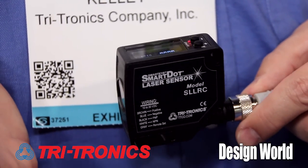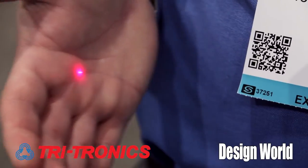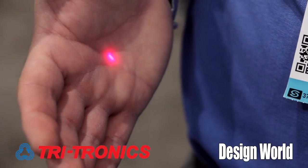Yes, this is a long-range laser. The SmartDOT normally went out to about six feet or so, but we had a couple customers that asked us specifically for 20 and 30 feet range to the reflector, with no misfirings up close. So we had to continue to polarize it and yet shoot it all the way to the reflector 30 feet across the room. We were able to do that within about three days and turn a sample around to the customer that they could test.